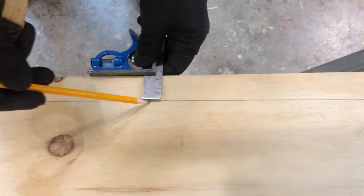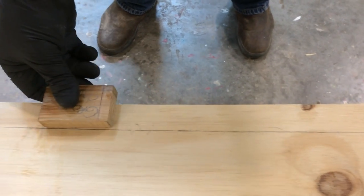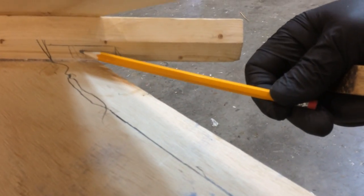You can put that line on like this with a combination square at the right spot, or you could use a block of wood and get a good idea where the glue is going to go. Make sure you get glue inside this notch because the chine should be glued into the frame too, all along here, and also the ends of this chine need to be glued to the stem. So I need to apply glue here and glue on the ends of the chines. Very important.